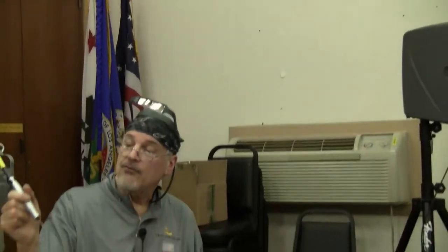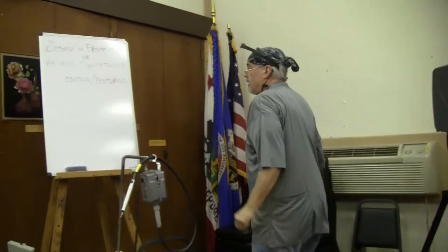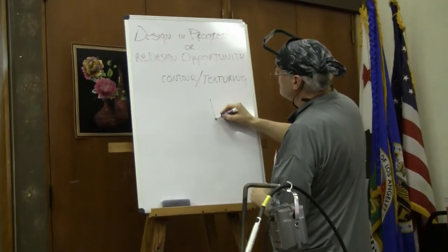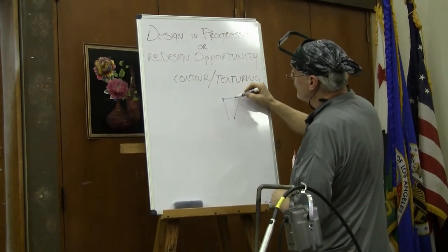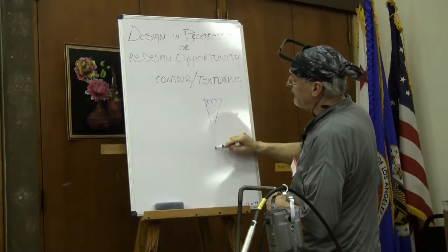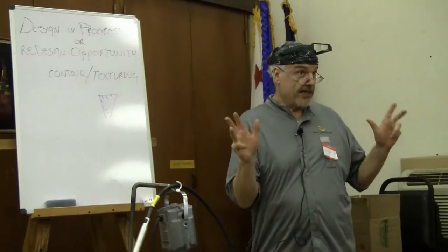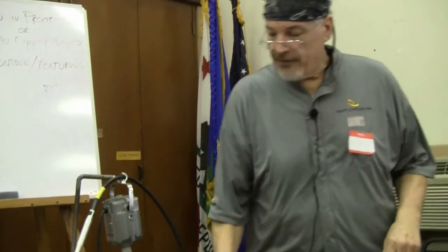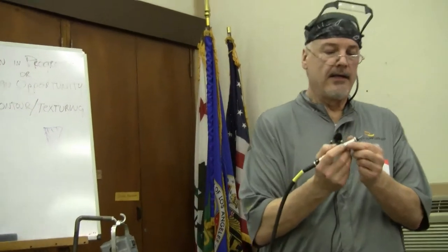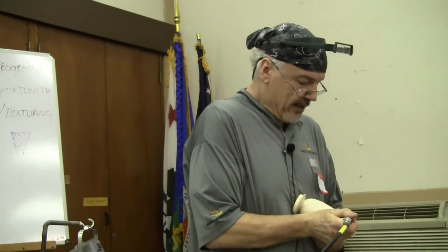And what we're going to do is start with a dovetail. Is everyone familiar with what a dovetail is? Dovetail burr. Basically, a dovetail burr is this. This is your cutting on it. It's a crisscross burr. There is no cutting surface on the top part and then the shaft. And I'm using 1/8 inch shafts for everything. Does that explain everything? The cutting's only on the sides. Only on the sides. And what this will do is allow us, once we put our drawing on this thing here, to clean up and follow that edge right along the way.